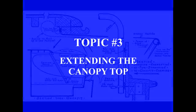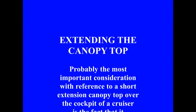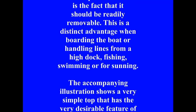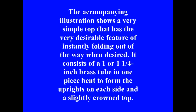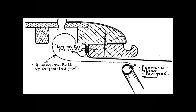Next, select the canvas of the desired weight, cut and sew to the proper size using lift-the-dot fasteners at the forward and aft edges. The forward edge should turn up and fasten under the edge of the permanent top as shown. The aft edge of the canvas may be snapped to the fasteners that are tapped into the swing tube frame. Other methods may be employed with success, but the dot fasteners provide instant removal for washing the canvas.